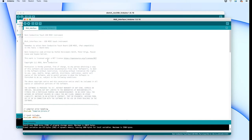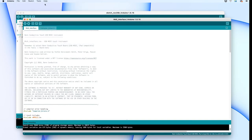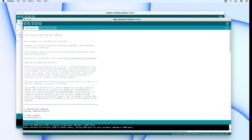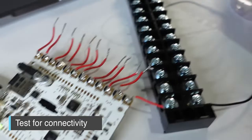The default settings are good enough for what we're going to do. Compile the code to make sure everything is working. If you get an error, you probably need to change the board setting — go to Tools > Board > drop-down menu and select the Bare Conductive mini. Also go down to Port and make sure you're on the USB modem port. Those are the two changes you'll need to make, then hit the upload button beside the compile button to upload the code to the Arduino.